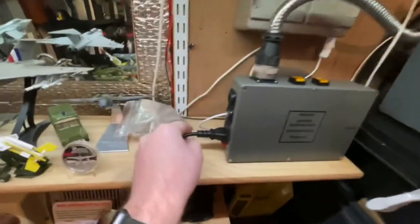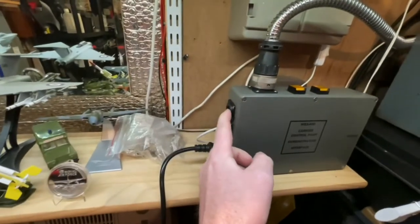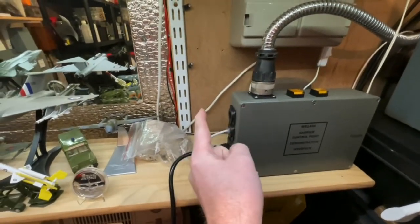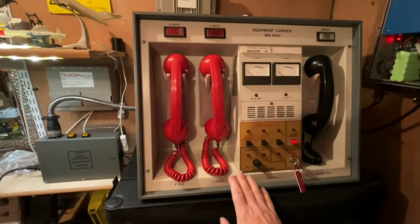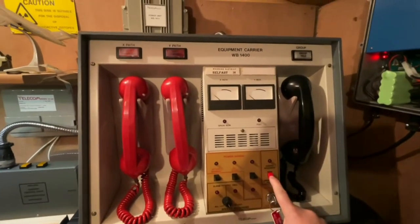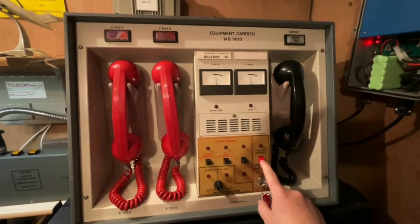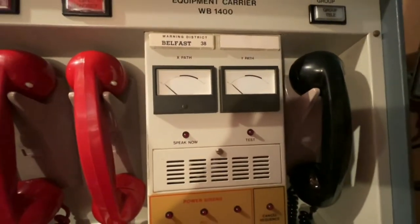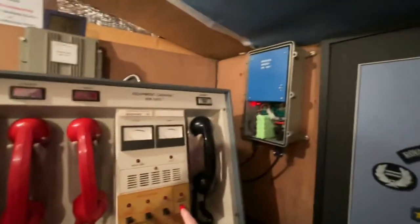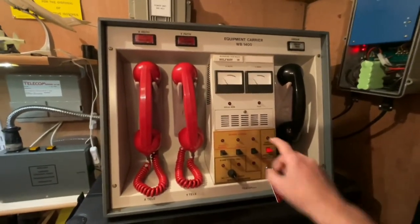The box has a 240-volt connection, an RJ11 so I can connect it up to one of the speakers, and a telephone connection for future additions. The carrier control point is powered normally, but for emergency power there's a 12-volt battery inside. I can hold down this button so it runs off 12 volts — meaning that in the case of a full power failure you can still send out the confidence tick, which is shown up here. I have this connected to two warning speakers, and you can see the red light is on inside — it's being powered and working as it should with the emergency power.